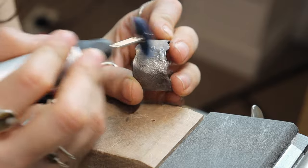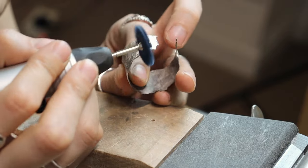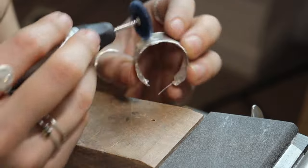The next thing on the list is rotary tools — specifically some sanding discs. I like using these radial discs. They have a different color for each grit. These radial discs are for sanding and polishing. I use my rougher ones when I need to sand away a scratch. Getting to the green one, the finest grit in the pack, does make it shiny, but you're also going to need some polishing mops and polishing compound if you want to see your piece really shine.